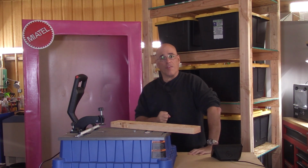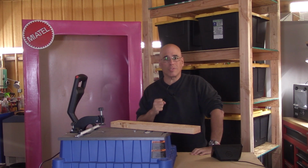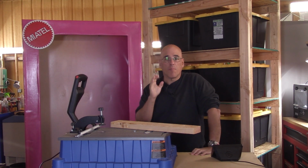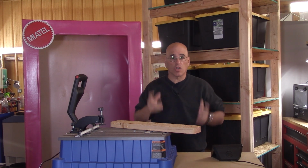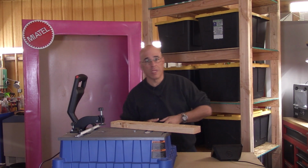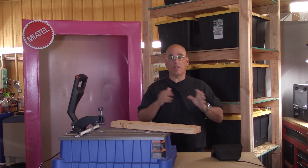Anyway, with my newfound way of attaching wood, I decided to create a rolling cart for totes and some other junk, which is what I'm going to detail next. Very easy to make with a bunch of 2x4 lumber and some OSB wood panel for shelves. It is sturdy enough to carry 10 of these black plastic totes from Costco. That means we will need 5 shelves measuring roughly 4 feet by 3 feet.